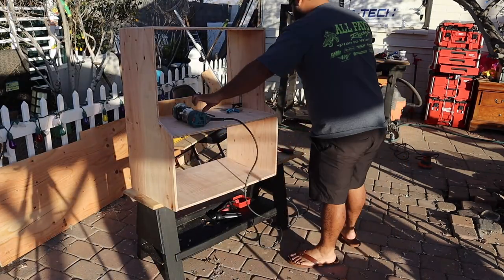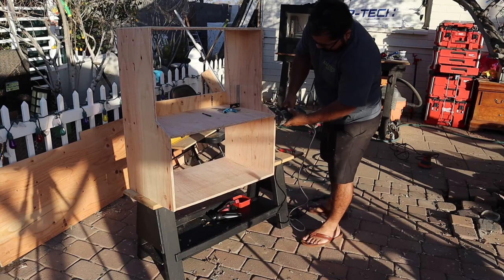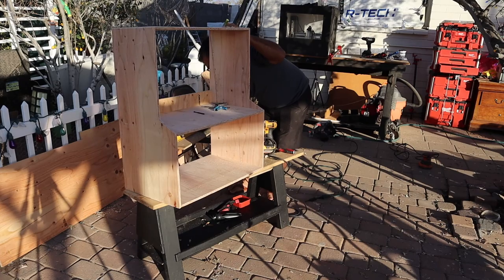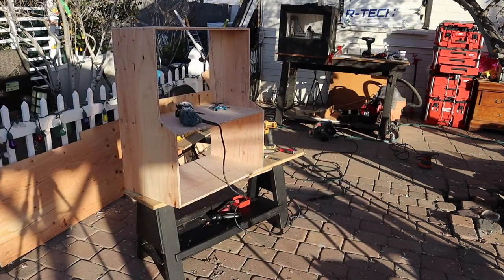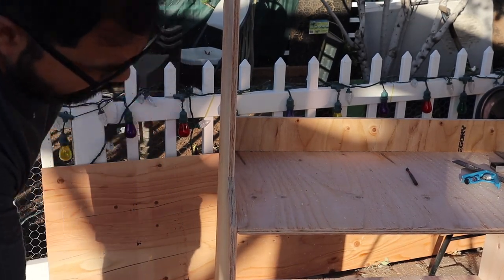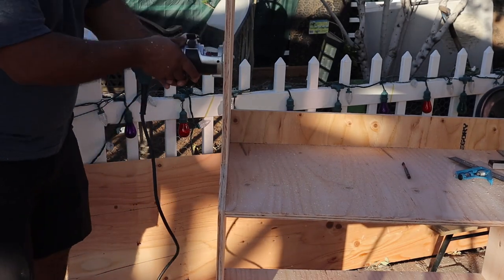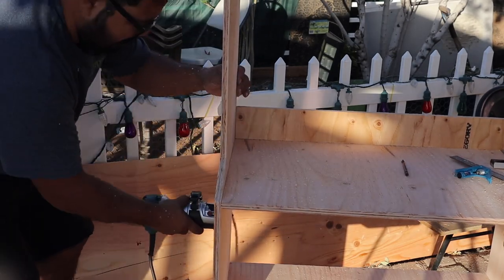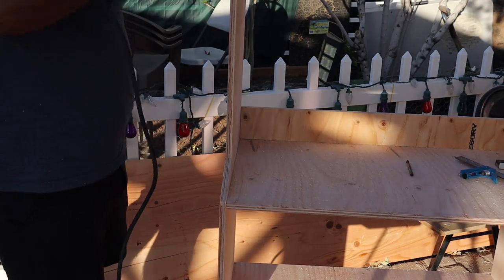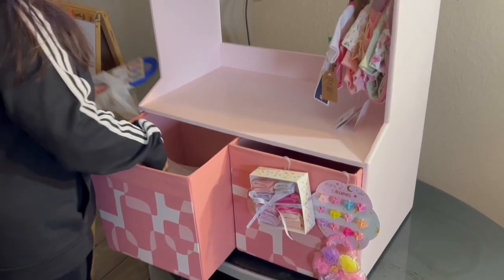After going around the whole thing to make sure everything has a nice roundover, I give it a light sanding and add a little more dab filler on those edges to hide the plywood. The plywood has end grain on some of the plies, and when you paint over them, the end grain absorbs more paint and has a different texture — you end up seeing all the plies, and it's not a good look. The dab filler and primer really took away that plywood feel.